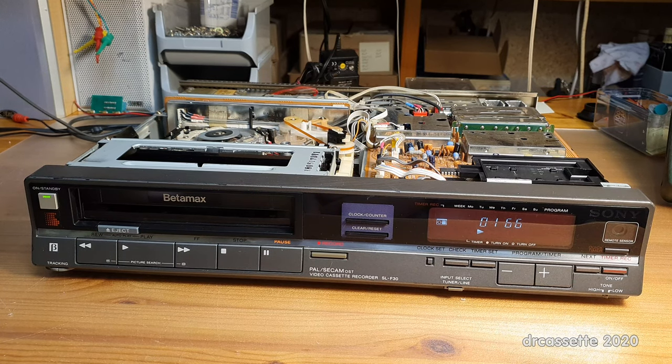I've made another test recording of color bars, but just as expected, no difference at all. The dark horizontal lines are still there, so I guess this is a fail. I'm not among those who believe that any problem can be fixed just by replacing capacitors — absolutely not. But this is what I read on the internet. It seemed to make sense, so I gave it a try. I don't have a service manual for this recorder, so no schematics, so I can't really investigate any further. So I guess now it's your turn — if you have any helpful suggestions, post them in the comments below. Sometimes things just don't go to plan. Thank you for watching.